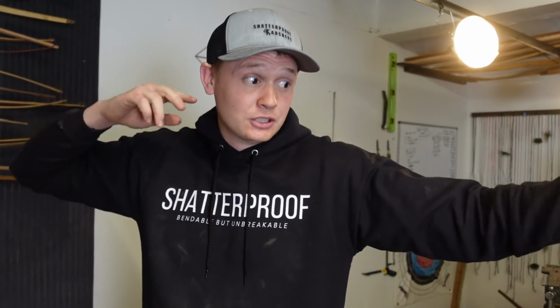And one more quick note, as far as crossbows go, this is a very low poundage crossbow. Because I'm taking a normal bow that I can just pick up and shoot and turning it into a crossbow, it's very light poundage. It's gonna be under 50 pounds when crossbows can go hundreds and hundreds of pounds high. So this is a very light crossbow, and I think that's probably a decent way to start so that it doesn't freak me out so much that my trigger system's gonna fail.